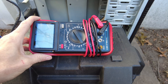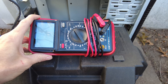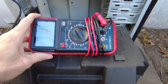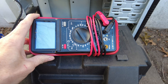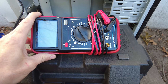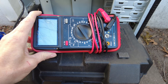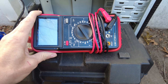We're going to see how it does. At the same time I'm going to hook up a meter — I wish I had an oscilloscope that could handle it — and I'm going to see what it draws. I'm going to pay particular close attention to when it's at the very end of its cycle and see if I can see a spike in current right at the end of its glow plug cycle. I might be able to see it with a meter. That power supply was rated at 25 amps for the 12-volt rail.